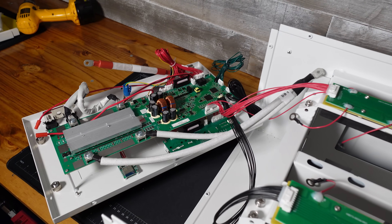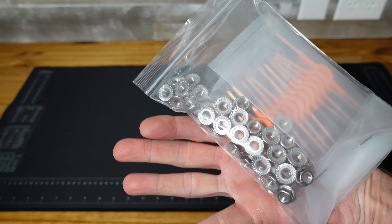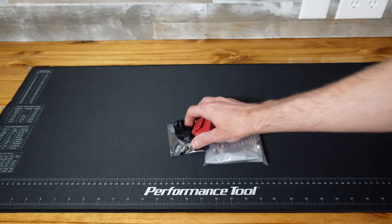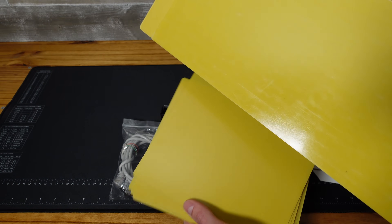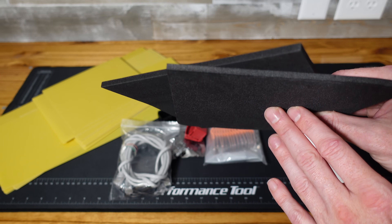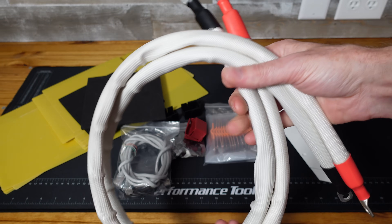Let's take a look at the rest of the accessories. We have a large pack of flexible bus bars — these are comprised of several layers of copper with a layer of nickel on the ends — along with a large collection of serrated flange nuts for the battery posts. We have a bag of bolts for the front terminals, plastic terminal covers, a communications cable that appears to be USB to RS-232, a set of two rack ears, a large pile of epoxy board for the bottoms and sides of the batteries, one small piece of epoxy board per cell, two dense closed-cell foam pads for the end of each battery pack, and two very nice positive and negative cables — about two and a half to three feet, and they feel like number four.